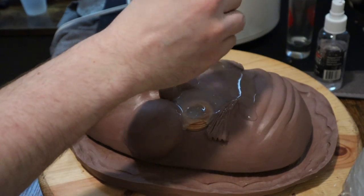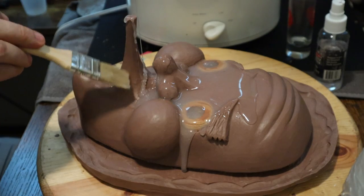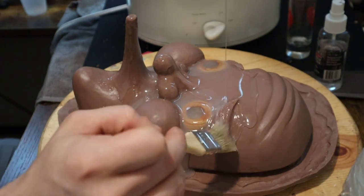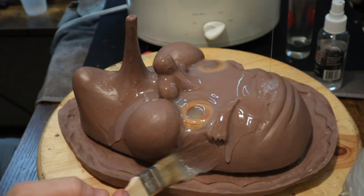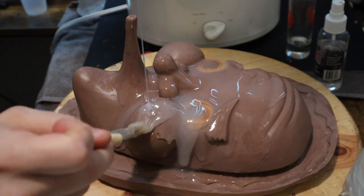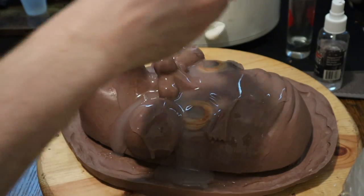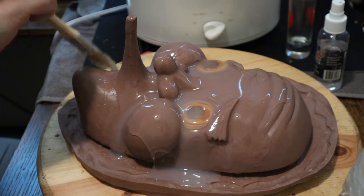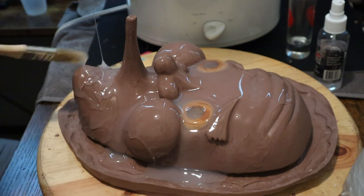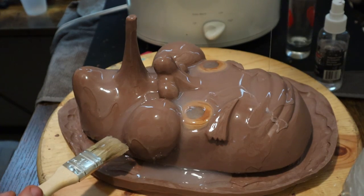This is the print coat — non-thickened, straight-up well-mixed platinum silicone. It gets drizzled over everything. This is a hybrid of things I've seen other people do. I can control where bubbles might form and get a nice even coating that any subsequent silicone will stick to. You have about five minutes before PlatSil Gel-25 starts to gel and get sticky. It's also surprisingly safe for your skin — it's a food-safe silicone if you follow FDA food-safe procedures.